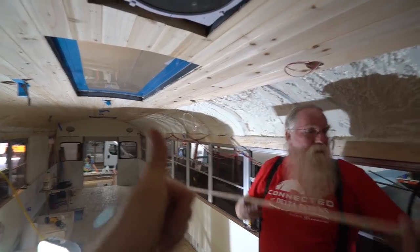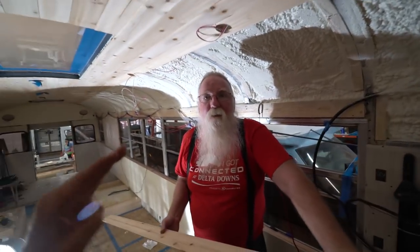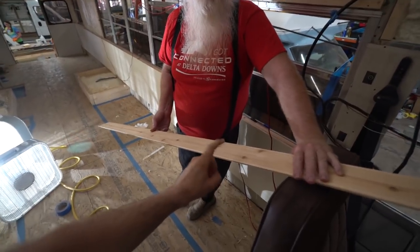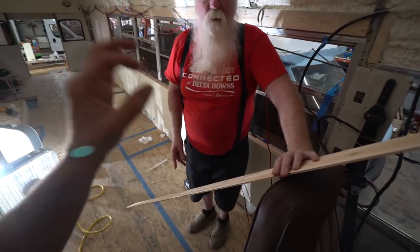Good news, we didn't screw up like we did yesterday, yet. Knock on cedar planking. Also, Steve told me shiplap folds over on top instead of in through the other one. And if you at home are thinking about a school bus conversion, I would highly consider not cedar tongue and groove. It's too brittle, it's too thin, it's too much of a pain in my ass.